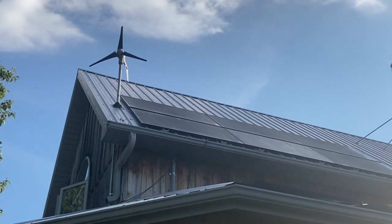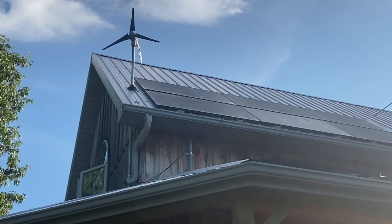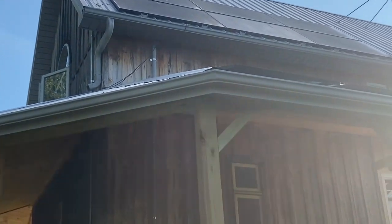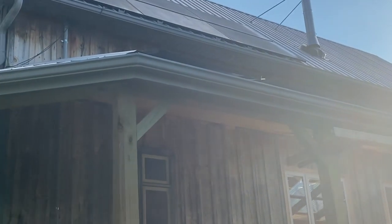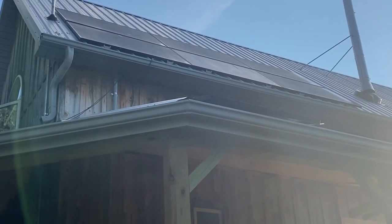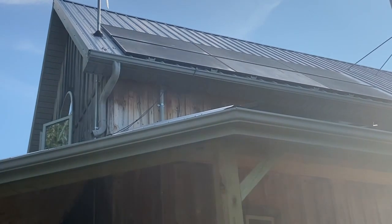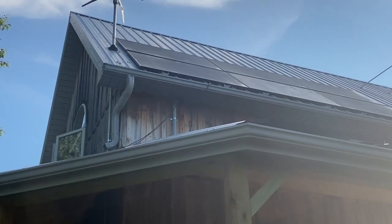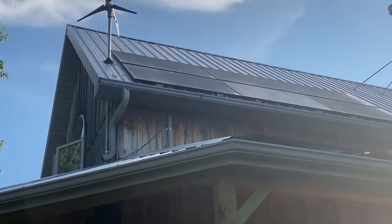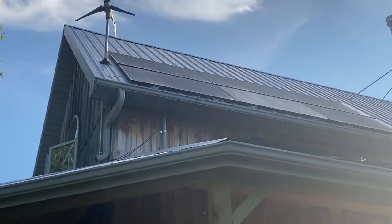As you can see right here, we've got the wind power — I think that's an Aromax unit that we put up there. It's really bright out here today. We've got six modules up top on the upper roof, six modules on the lower roof on this side, and then three modules over on the other side, kind of southwesterly facing. This took about two and a half days to rack all this and run the wiring into the structure. It was quite a feat because it's one of the steepest roofs we've ever done, but we got it up there for them and we've got them online. They're very pleased with it, and I'm going to step inside and show you the interior work now.